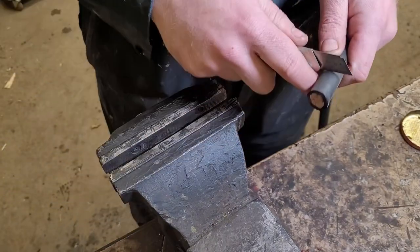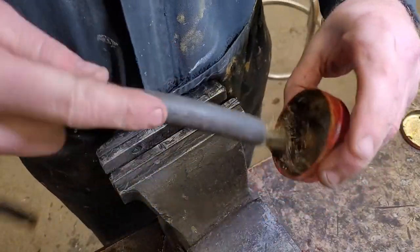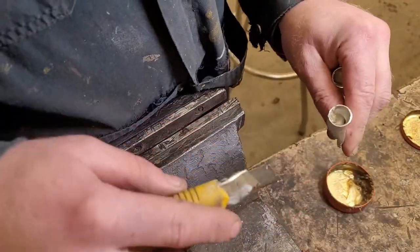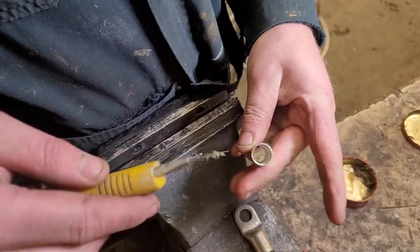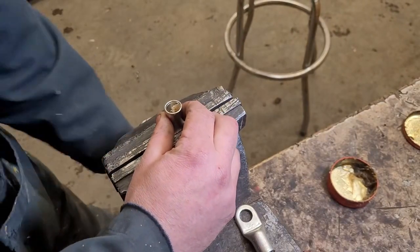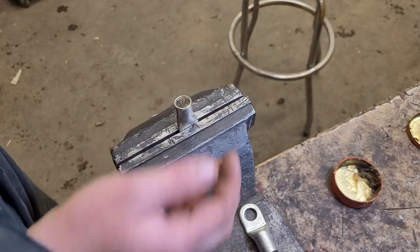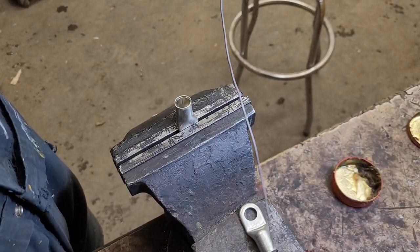So for the skid steer, we gotta build a positive battery cable. I'm gonna dab both ends in some flux, put it in the terminals, and then we'll put the terminal in the vise. You can purchase these small soldering plugs. It's easy, you just slide them in, heat them up, and it's the perfect amount of solder, but I'm just gonna go the old fashioned way.